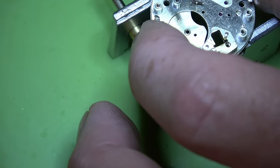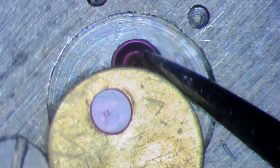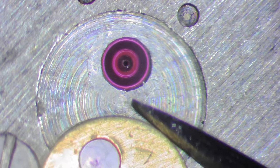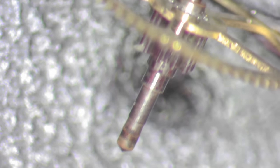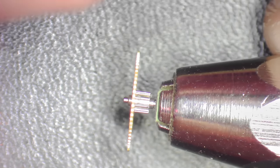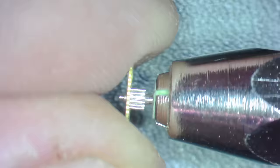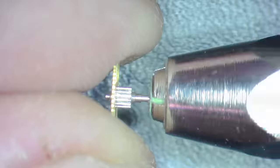For cleaning I'm going to take these cap jewels off, remembering to put them back straight away before we start reassembling anything else. And then we've got the pivots on these wheels — as you can see there's some rust. I'll get a bit of EVE stick and give those a clean before they go into the cleaning machine. I'll show you one pivot here — you can see the difference it makes.